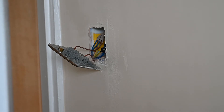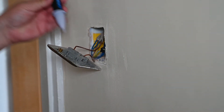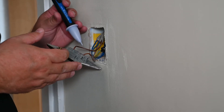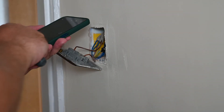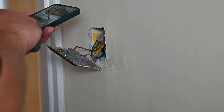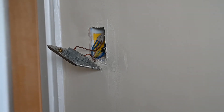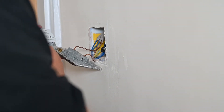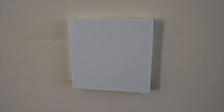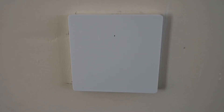I'm going to install the wall switch now. If you're not comfortable working with electrics, please seek the assistance of a qualified electrician. If you're going to do it yourself, best practice is to take the fuse out of the fuse box so nobody can accidentally turn everything back on whilst you're working on it. Always use some kind of tester to make sure those wires are actually not live. Also, take a picture of the wiring before you disconnect anything, so you know how the wires go back — otherwise you'll be calling out an electrician. Now I've got the switch fixed in place, it's just a case of pairing it with the hub following the same procedure as for the scene switch.